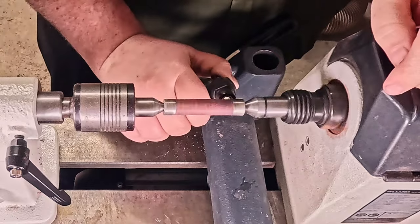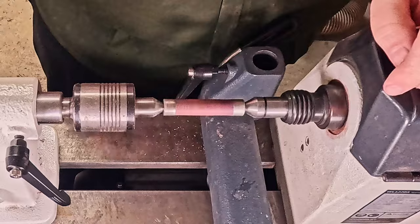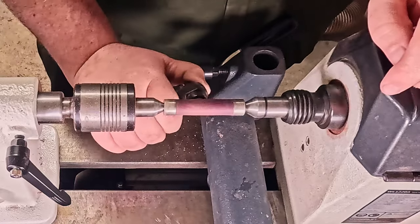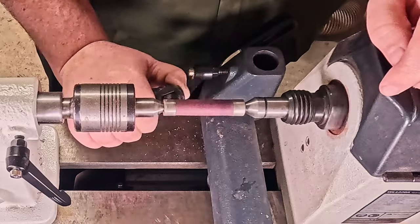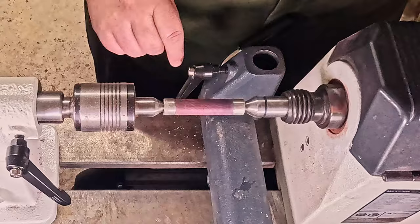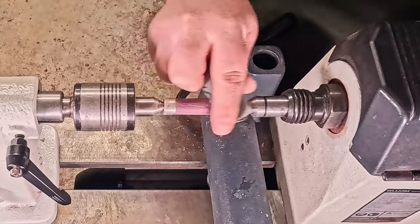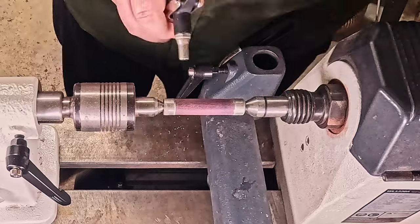You may notice the purple's actually coming out a lot faster here. I suspect that's because I'd already released the oils when I took the torch to it originally. I also didn't take it quite as far with the purple as on the base. As I've discussed in my previous videos, Purple Heart will get more purple over time, to the point where it will eventually turn black — though that usually happens over decades, not overly quickly.